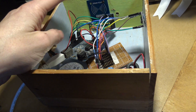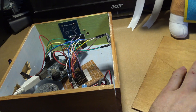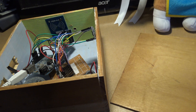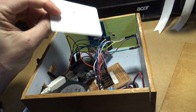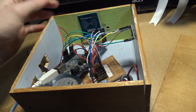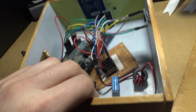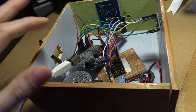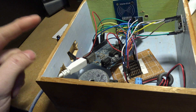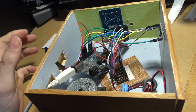That is basically it — an Arduino Uno. It continuously looks for an RFID card, and when it finds one, because these all have their own identifier on them — a 4-byte code — it checks against its database to see if it recognises the ID. If it does, it plays a sound and changes the mood light by sending the code to it to change to a different colour.